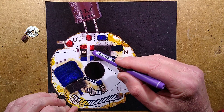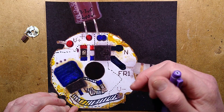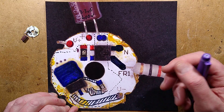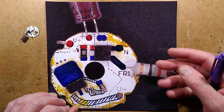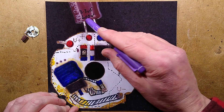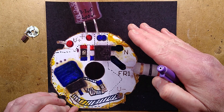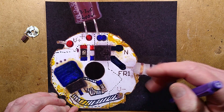That 1 megohm resistor serves three purposes: it discharges the capacitor so you don't get a tingle off it; it applies a slight load to prevent the ghosting effect you get with LEDs, because this lamp would be very sensitive to leakage through capacitive coupling between switch wires that can make the lamp glow even when off; and it ensures the capacitor discharges fairly rapidly so the filament goes out quite decisively rather than fading away very slowly.